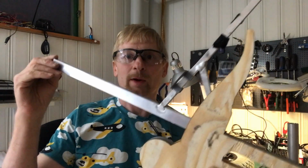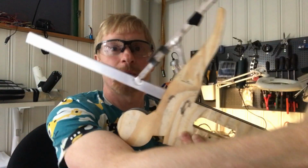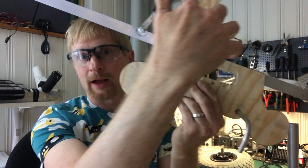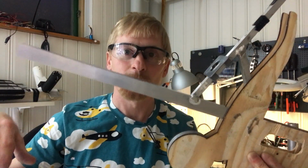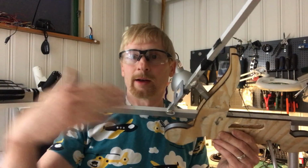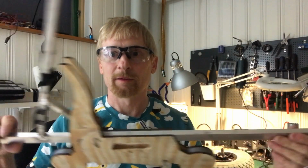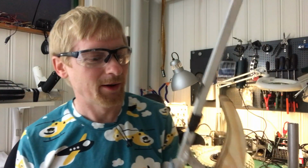So instead of going this way, having dirty air going through one rotor, and also less efficiency because the air is sucked down with the first rotor, the air is actually pre-accelerated on the next rotor, and you have to compensate for that, or the control system does that automatically, but it consumes power. So I just flipped the concept over this way and have almost totally clean sweeping of the propellers, and it looks just as weird anyway, so it doesn't matter.